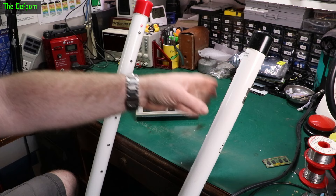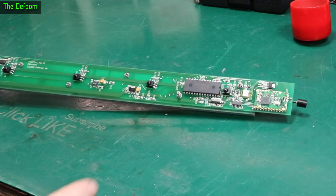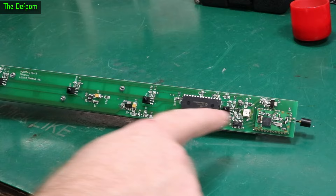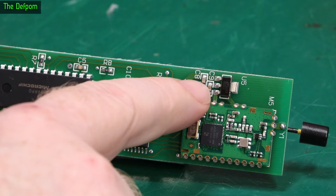So I'm going to pull this out and fix that transmitter part, and also fix this LED which is a bit intermittent. I've got the assembly out of the actual unit. There's the backboard, and here's the circuit board. There's the top piece, the top section. There's the processor, got a crystal there, there's an infrared sensor, there's the indicator LED. This is the RF module, and obviously there's the antenna. It's got a little voltage regulator here as well.